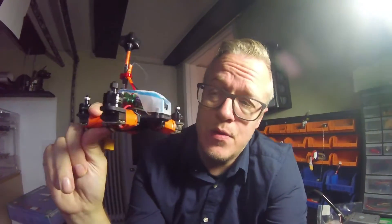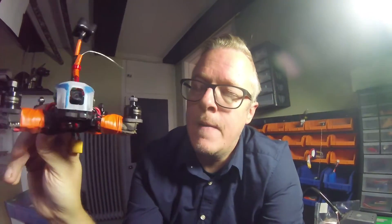I am very curious to see if the Atom V2 that I'm going to get is actually better or worse than this, because this one with an 800mAh 3-cell battery weighs 145 grams — which is less than the Atom V2 with an 800mAh 3-cell battery weighs. So in theory this outperforms it, and it doesn't have the OSD or a lot of the stuff that the other one has. But this is on KISS hardware, which means that all I've done is taken the PID settings from my big quad — which flies fantastic — and put the same stuff in here. I didn't know if it was going to work, but it works exactly like the big one.